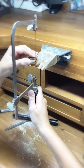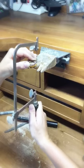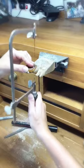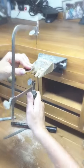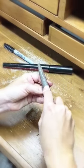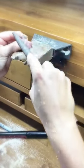Since this is on a curve, it can be a bit hard to start, so just easy does it. Make sure you're going straight up and down as you're cutting — it's really important to make a straight line. There's one side, and we'll do the other. As I mentioned, you can see some wonkiness from the wax saw blade due to how coarse it is. Now we're going to use the file to smooth it down. Without the bench pin the piece shakes, so the bench pin really comes in handy for creating a sturdy position to file from.